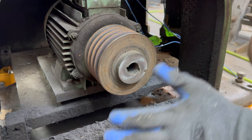There's another knob on the selector for the gearbox on the side. That pin was hard to remove. I ended up putting a board underneath to support the knob so I could pound the pin out because I didn't like pounding on an unsupported 80-year-old cast iron arm.